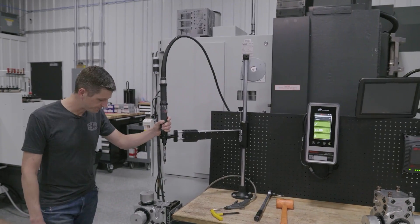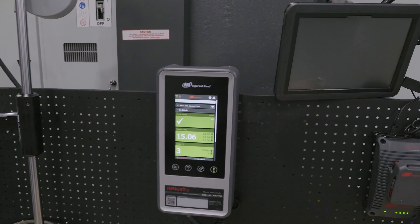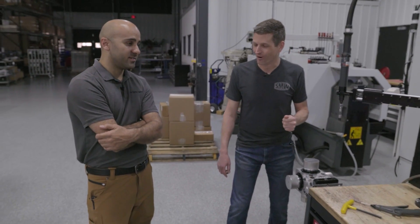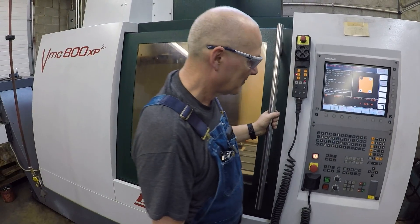We saw a tool at Area 419 — an Ingersoll Rand digital torque system — it's pretty cool but about twenty grand. It has a computer on it, you can program a fixture, and it will count when you reload and say it needs to see 10 screws each torqued to 25 foot-pounds. It automatically adjusts, and if you don't do all 10 different screws it alarms out — but it's twenty grand.